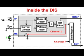If both comparators output high, a debounce filter delays the input signal by a user-defined debounce time. If the input signal outlasts the debounce time, it is accepted as a valid input status, and the filter output changes in accordance with the input polarity. The filter output state is now ready to be latched into the shift register via load pulse from the controller.